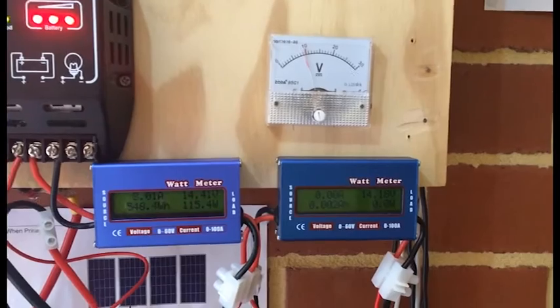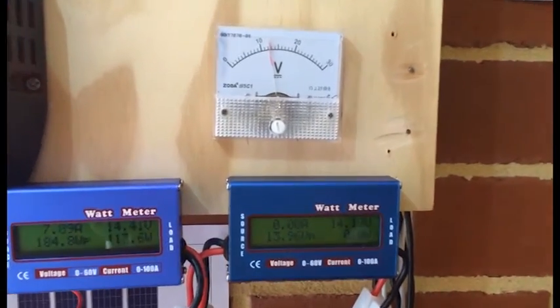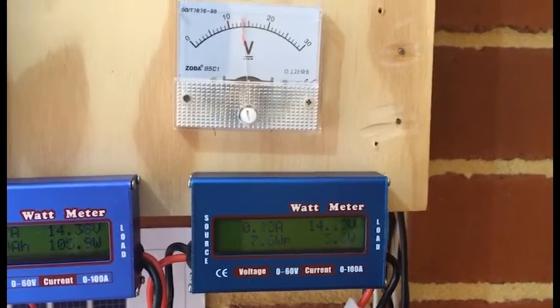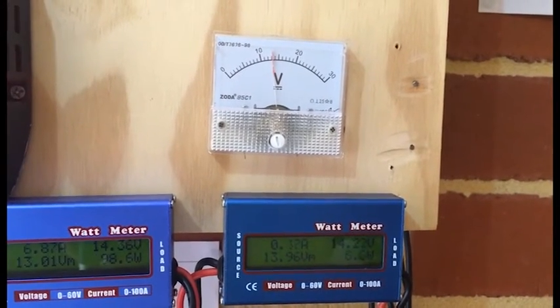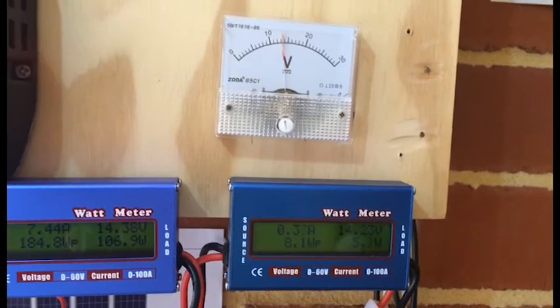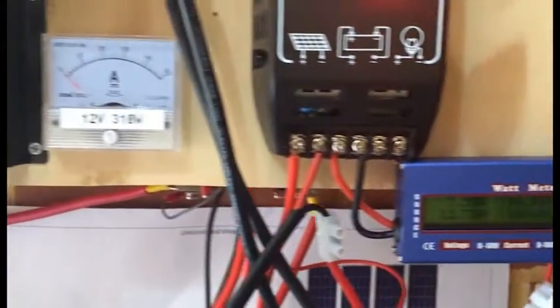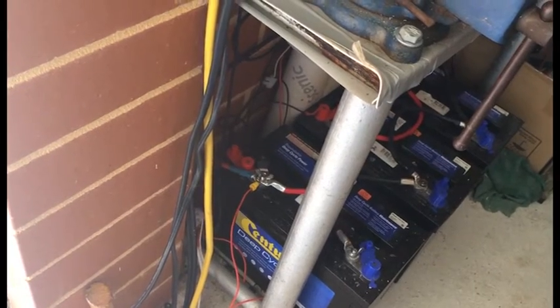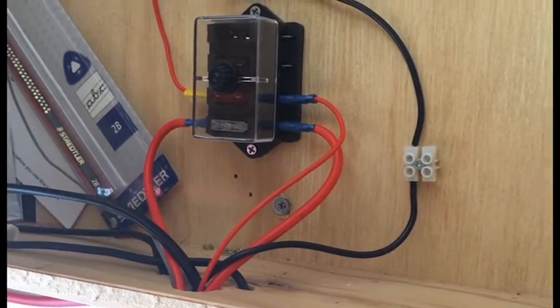And there we are YouTube — I've done it, tidied it up. The one on the right is the wind turbine. Everything's kind of the same — I moved it all from here and made it look a bit nicer. It's fused into the second one which is a 10 amp, and the next one under is a 20 amp which is a string of my solar.